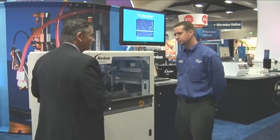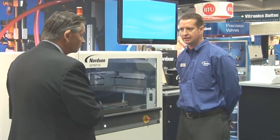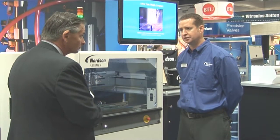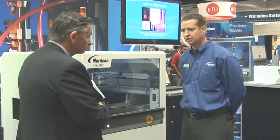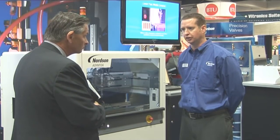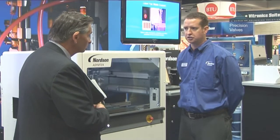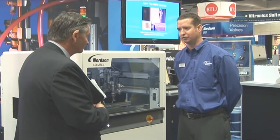The software driving this is Nordson Asymtek's proprietary EasyCode control software. It has graphical user interfaces and is a very easy-to-program system running in an XP environment with very high reliability. There are two main windows: an engineering window where everything is taught and trained, and a production window where operators can run and select programs but not modify them.